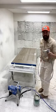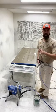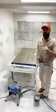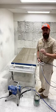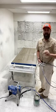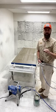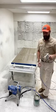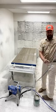All right, so pay attention, proper spray technique. You can see everybody recommends somewhere between 8 and 12 inches, give or take. I will say you go however you like. The distance from the substrate to your spray gun like this is going to be determined by your rate of speed. I tend to be a little bit speedier with my speed, so I've developed a system over the years where I kind of hold mine pretty close, especially when you're outside and you get a little breeze going. Sometimes I'm only a couple inches from the substrate, but your hand's moving as fast as they can.